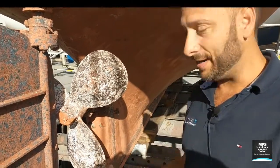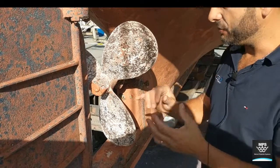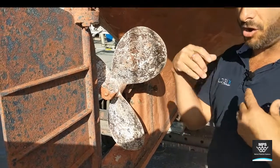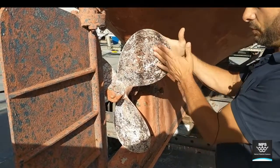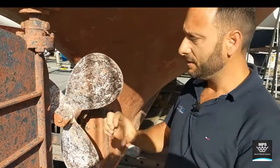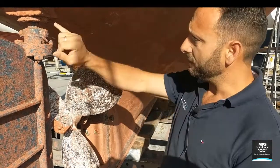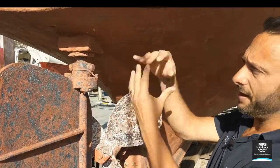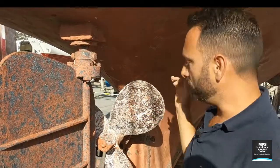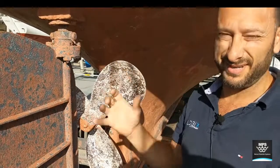This style of boat has had zinc anodes on it for a long period of time. They've been wearing out, and you can see the cathodic disbondment of all the coatings. That is a high reaction between bronze, stainless steel, and the anode. It's got a very big cathodic difference causing all the coatings to react, and what happens is the over-anoding situation will also damage all the timber around all your stern tubes and rudder tubes, which ends up softening your timber.